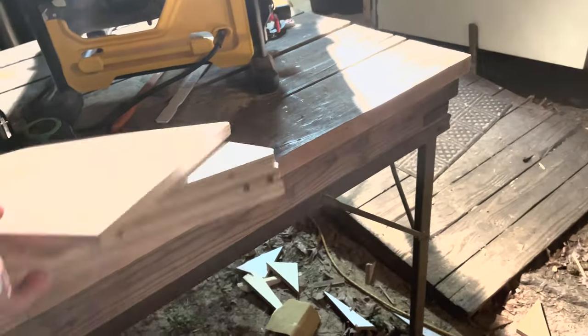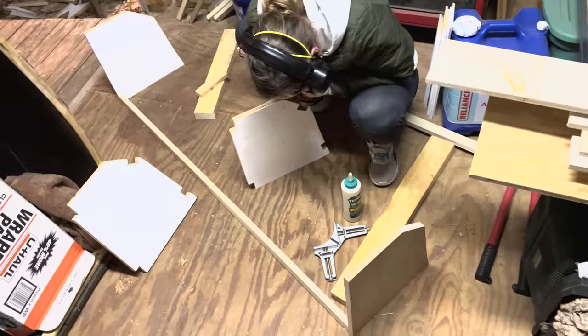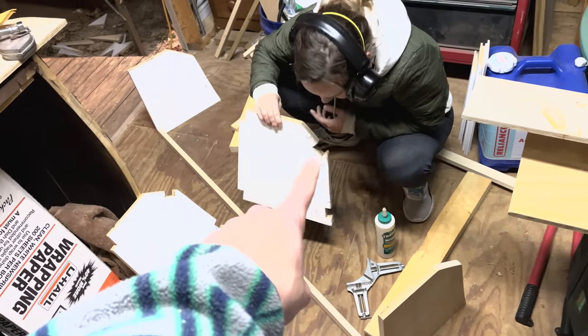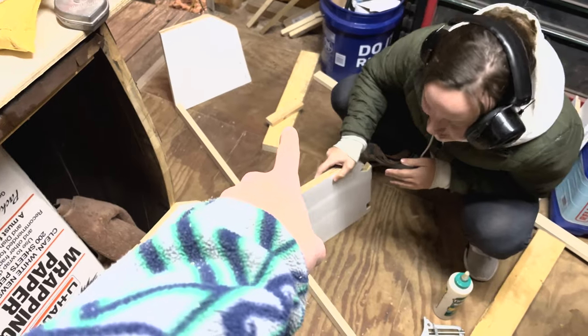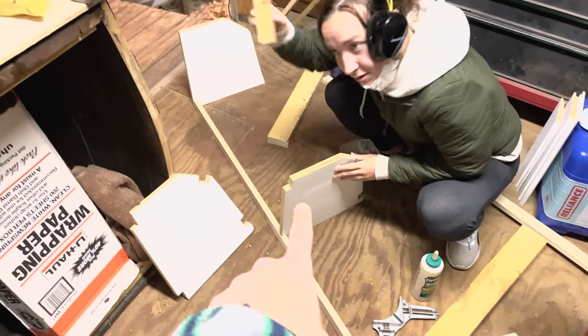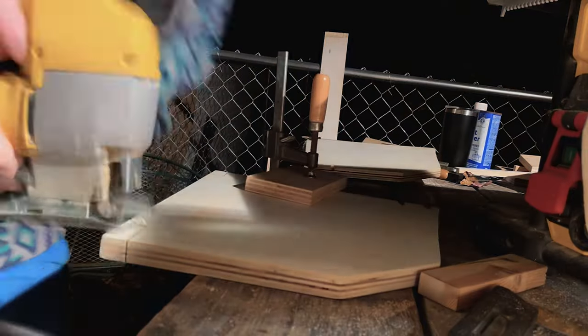We have the panels, at least for the back side. So this is going to be an edge piece. After they're painted and sanded, they'll go up in the corner, and then we'll run some beams across and put on some face plates. So we cut a lot of notches in here — looks like a puzzle piece. To make that easier, we just grabbed a tiny little one by two, stuck it up next to it, traced out the bits, and then cut it out with a jigsaw.